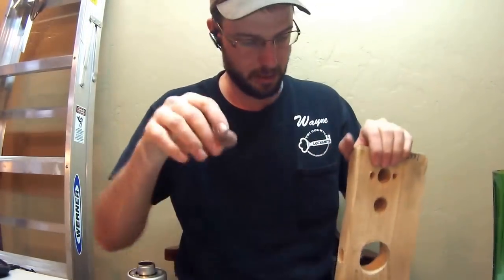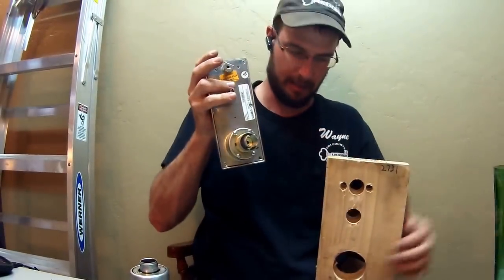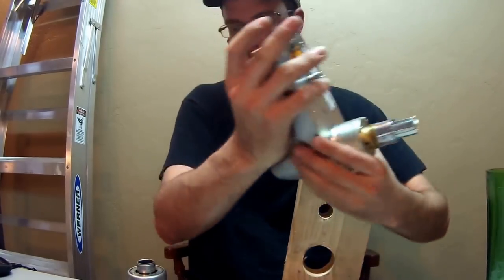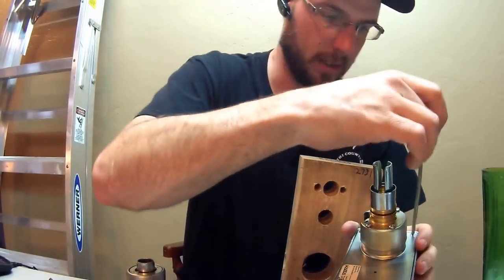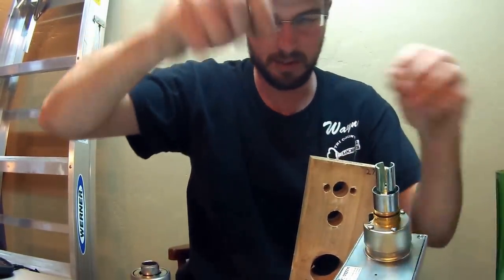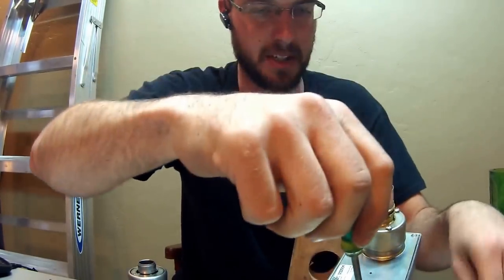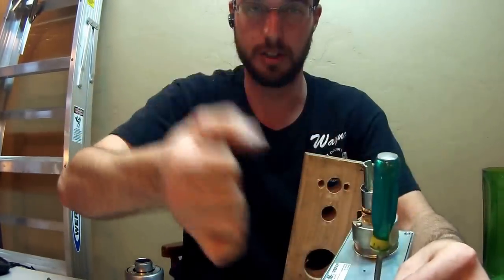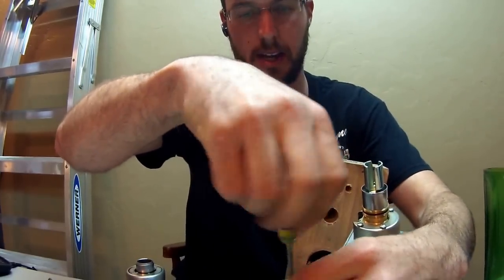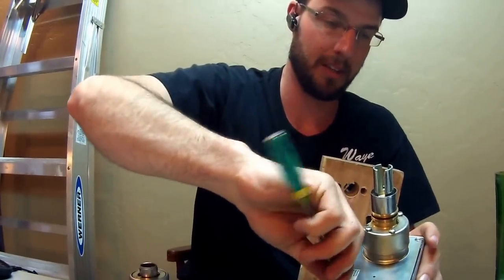Any commercial door should be ready to accept this lock. You're going to need to figure out the handing — if this was going to be the outside, then this lock would be incorrect and you'd have to take it apart and turn it over. An extremely important point: if you order the handled version with the lever, you have to order them handing-specific because you cannot change the lever direction in the field. The lever will be going the wrong way into the door jamb if you don't order the right one — I really stress that because I've done it before.